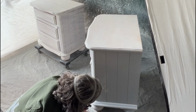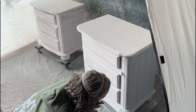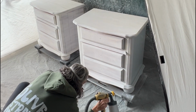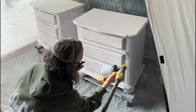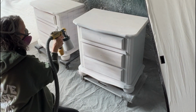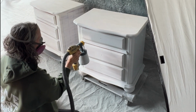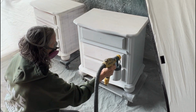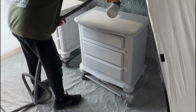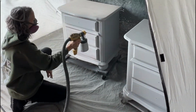So this is my Stix Primer. Again, it's tinted. If you watch my channel much, you'll see that I almost always use tinted primer. Typically I'm going from a dark piece that I've sanded a bunch of blotches and things through, and it just looks like a train wreck. So I like the gray primer. I feel like it just has better coverage. So just spraying all of this. This is actually a pretty thick coat. I have my sprayer setting set to have a nice, decently thick coat of primer on here.